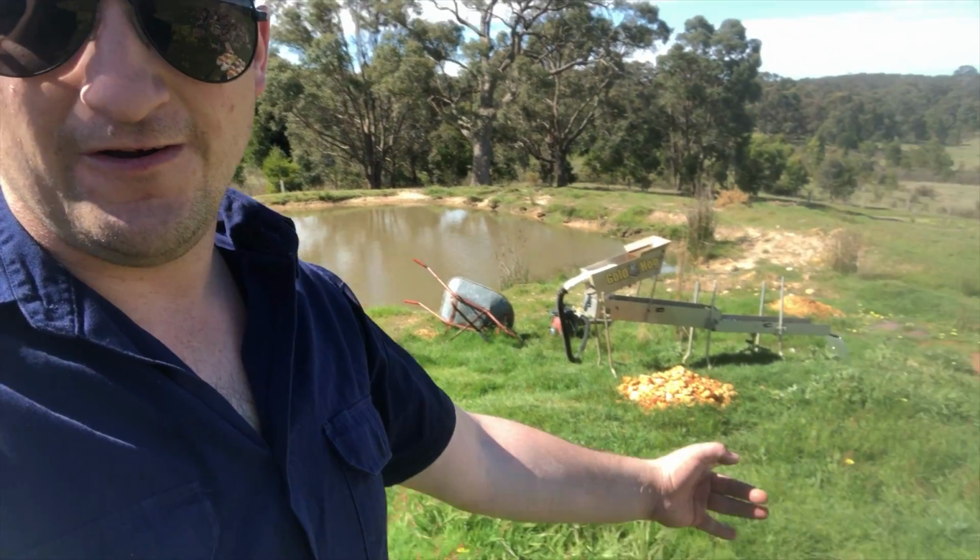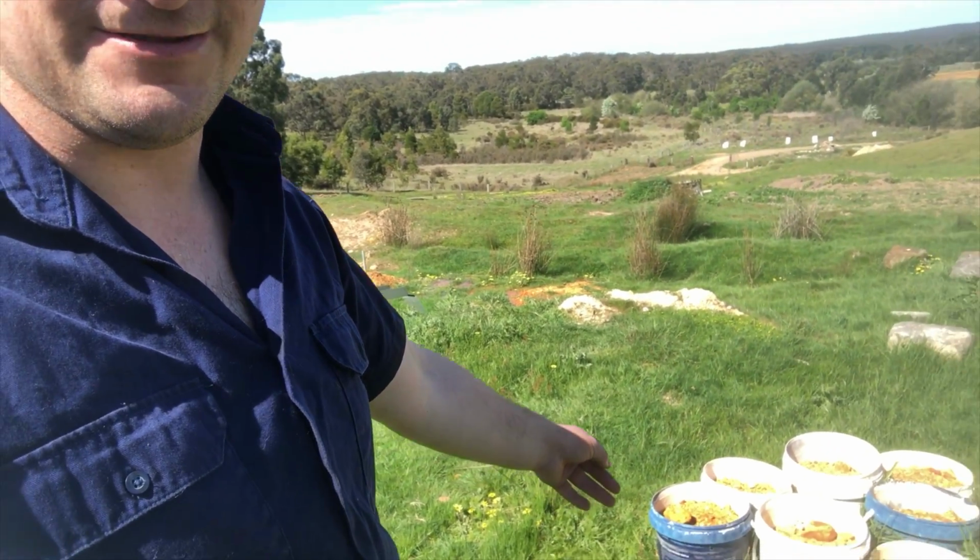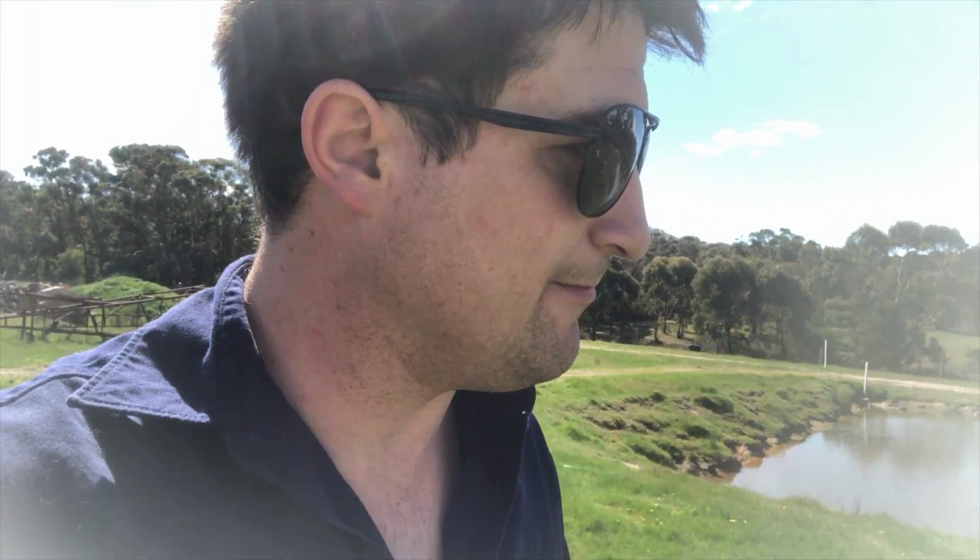It's at 14 degrees pitch on the first half, and then it flattens out to maybe 5 or 4 degrees pitch on that lower half of the sluice there. So it's just sitting there ticking on idle just for noise sake, and I'm going to run this through. It's from the same place, the same area that I got from the last time. So I might be able to put a link there on that video to show you the results there. But anyway, I'm going to run this through.